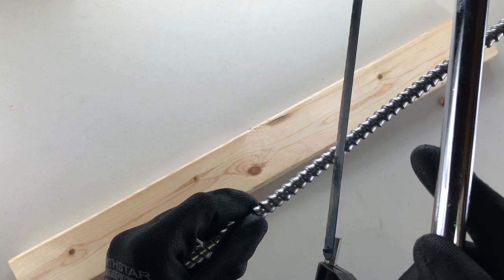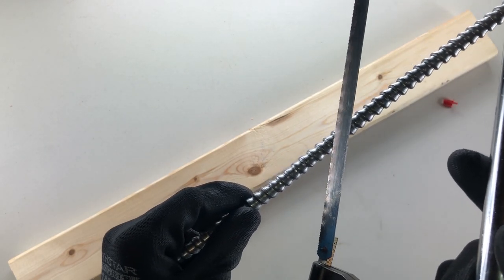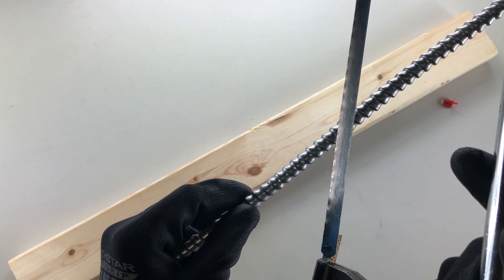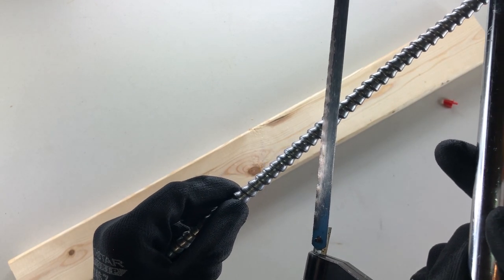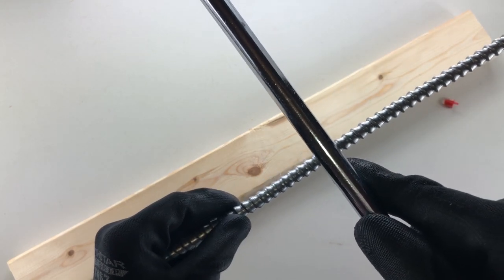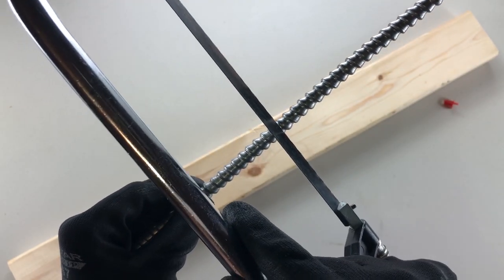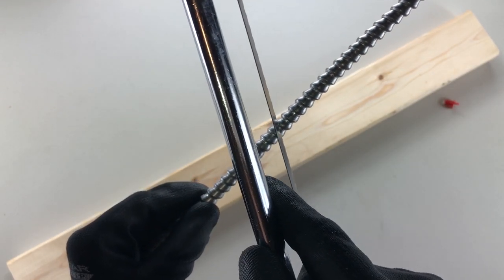If we are cutting on a 45-degree angle, we'll break through the entire length of one of the links that's wrapped like a candy cane up this cable. If we cut at 90 degrees to the cable, we're actually just causing a bit of a slit — we're not actually breaking through the link as a whole.